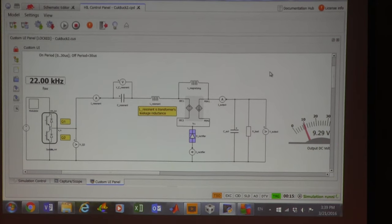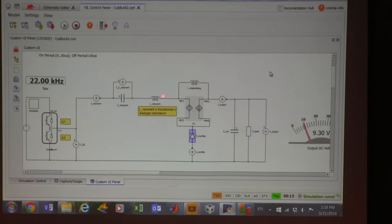If I have a 10-to-1 step-down in the transformer, 50 amps on the output becomes 5 amps on the primary side. I'm having a one-turn inductor on the output carrying 50 amps, while on the primary this resonant-energy-transfer capacitor only has 5 amps RMS current — how much capacitance do you need? You can put a 50-volt cap for 50-volt input, and if the output is 10-to-1 this will be a 20-volt cap. Use any 0805 chip capacitor with 3.3 A ripple current and put two of them — that's it. The resonant capacitor carries all the burden but it's on the primary side, and it's practically nothing.